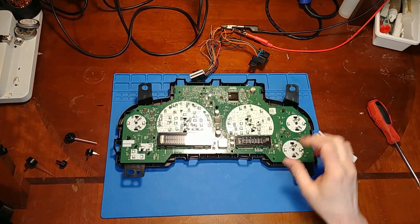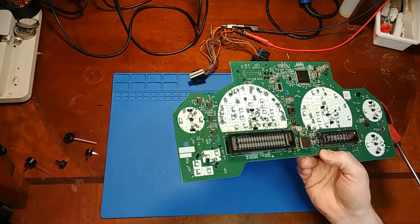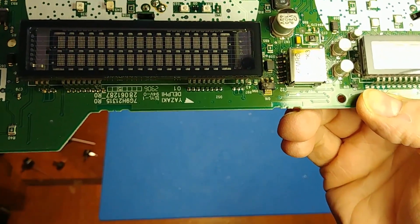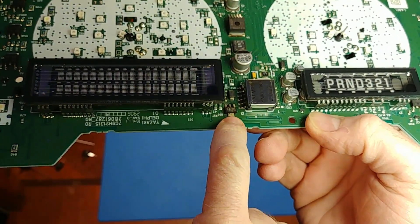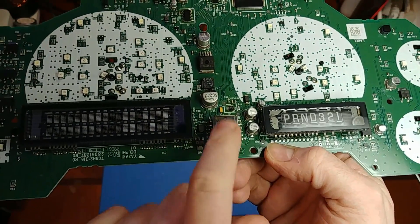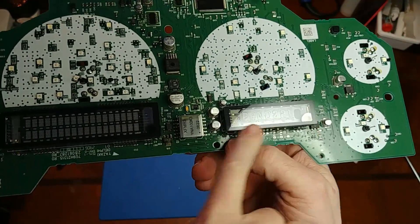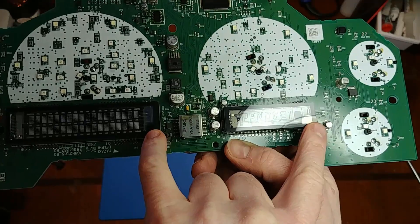Let's see what we've got here. We've got a MOSFET that has puked its brains. As you can see, we've got a hole blown. The MOSFET is in control — it runs the transformer, which is in charge of powering the displays. Some people see these little dark marks in the corner and assume they're burned out, but no, those are just oxygen indicators. Black is good.